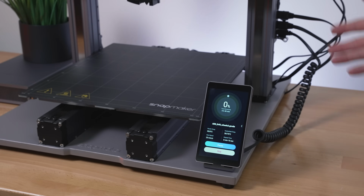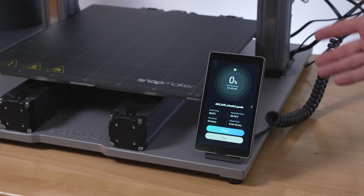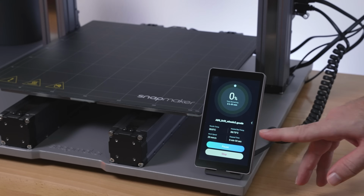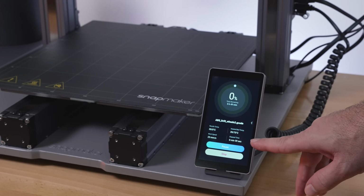Again, the software is quite polished, and you guys can see we're actually going to heat up to 75 on the bed, which is quite hot for this large bed. I believe the maximum recommendation would be 80. I know it does go a little higher, but it probably will take forever. It is warming up, but it's gonna take a while, and I'll let you guys see how long it's gonna take as we have a minute here started.